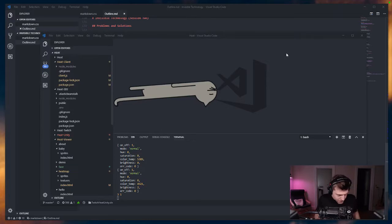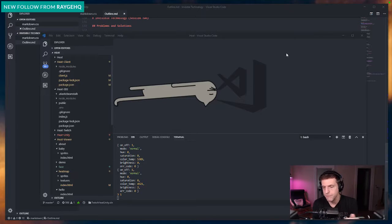So I'm going to do this in a pretty lazy way, I think. The purpose of this is these dudes are producing AC. And that's not what my microcontroller wants. I don't even know that I fully understand the reason this works. But if you just put a resistor across this, it will squash it enough that it's basically 0 to 5 volts. And that is good enough.